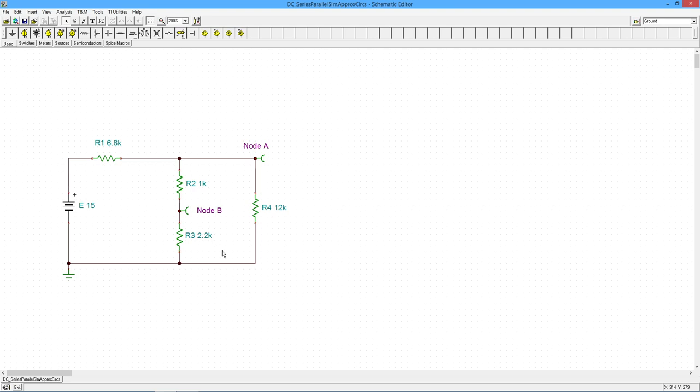You don't have to immediately run out and grab your calculator and start punching numbers furiously. Sometimes all you want to know is: am I getting about a milliamp, 15 milliamps? Is this going to be about three volts, six volts? So when you set up something in lab, you can see very quickly whether measurements are sensible or if something is clearly not correct — maybe a component is accidentally shorted, opened, or something like that.